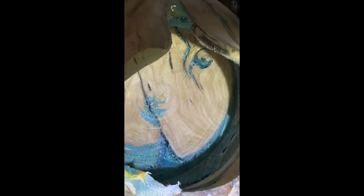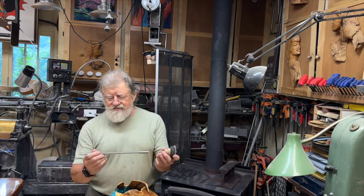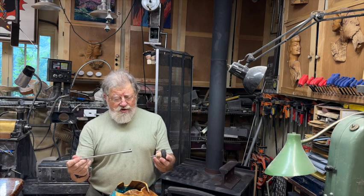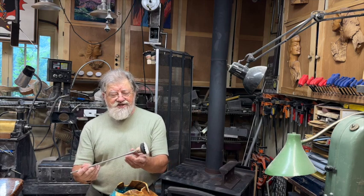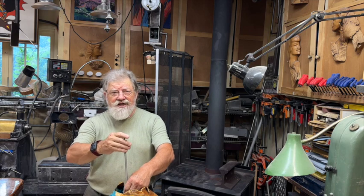The inside of this piece is pretty rough, especially down in the corner. The bottom isn't too bad — that can be sanded out. But it's awfully rough down in the corner. Here are a few of the tools I used for sanding the inside. This is basically a bit extender that you can get from any hardware store, and I put my sanding discs into that. The set screw locks them in place, which gave me the ability to go deep inside and get the sanding done.